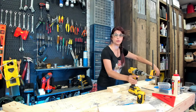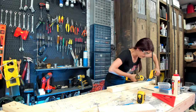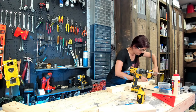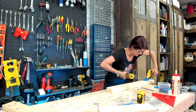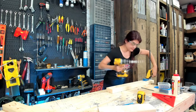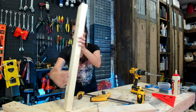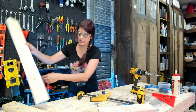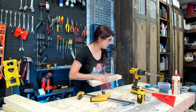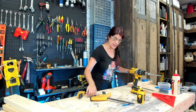And I got two more pocket hole screws on this side. All right. One more. Alrighty, so that is done, and then we just got the little support beam in the middle, our drawer support. I'm trying to do it over on this side so we don't get it in our work area, although this is kind of all of our work area. So let me put our four pocket hole screws here, two on each side.